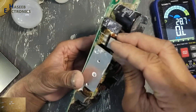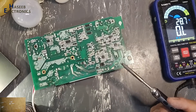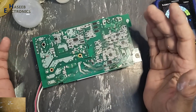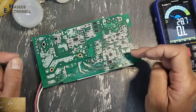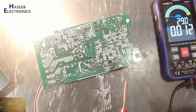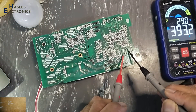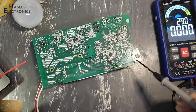Now I will install this MOSFET. Our next stage is the capacitor. It might work at 220V, but at high voltage the dielectric may short circuit and it will not maintain voltage. In no-load condition the circuit works normal, but when we apply load it may damage again. So we need to replace this capacitor as well. DC voltage — I will apply power. Yes, the PFC circuit started and it is taking too much time. The voltages are maintained now. Now I need to arrange a capacitor.